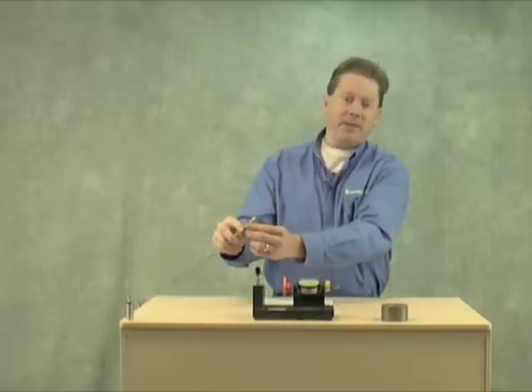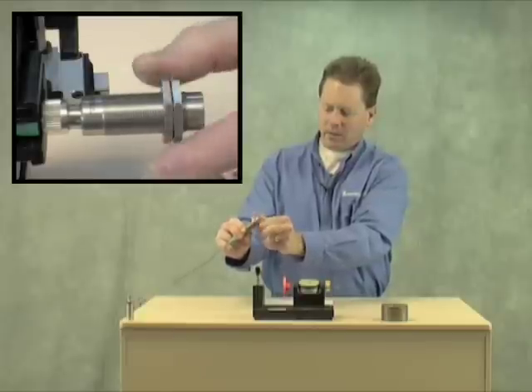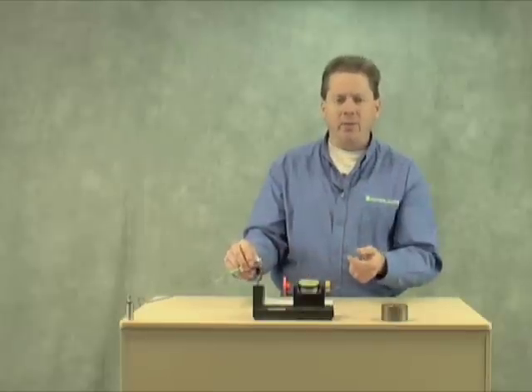Now let's take a look at the mounting of this product. The first thing we'll look at is the mounting nuts — that's how you mount most cylindrical sensors in a through-hole style. If we put these mounting nuts up near the face and use those front threads, you're going to have a problem where the sensor latches on. That's a very unstable sensor. Often times you'll also find that if the environment gets warmer or colder and it's just on the threshold where it may turn on or turn off, that heat will cause the sensor to latch on.